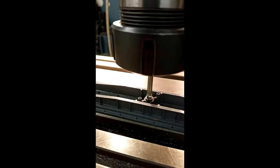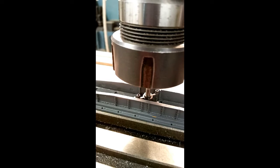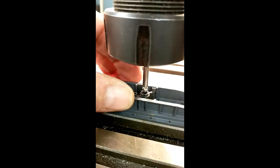Now it's quite critical that this shaft is upright in relation to the turntable base. So we set the shaft into the head of the milling machine. I'll just try and see if you can see that. Right, and then we will put some glue around the serration. We'll then put some glue in the hole. And then when we're lined up, we'll then drop it down on the quill feed. And then we'll lock it off in that position and allow 2 to 3 hours for the glue to set. That will ensure that the shaft is at 90 degrees to the rotating part.